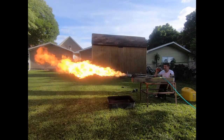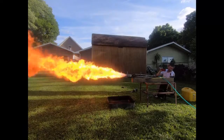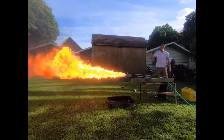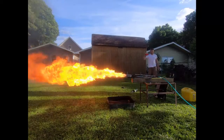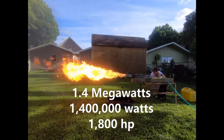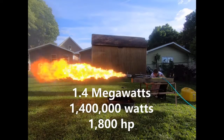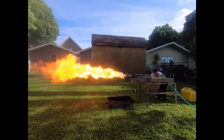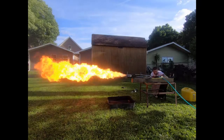Hey, what's up everybody. This video is for Tony and Carolina — we're working on their burner today. The subject is the emergency cutoff system. We have the thermocouple cutoff system, and we've seen the videos of that working, but there is a particular failure mode that the thermocouple system is just not adequate to handle, and that is an air compressor failure.